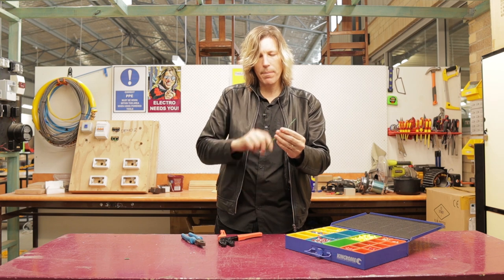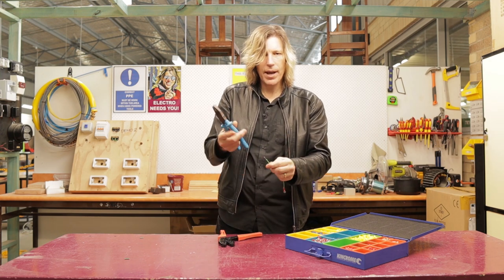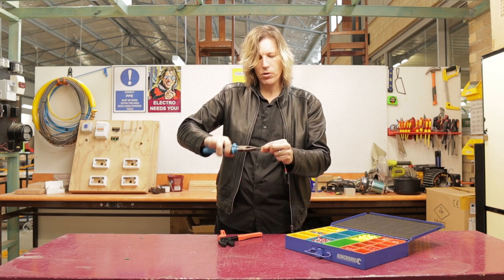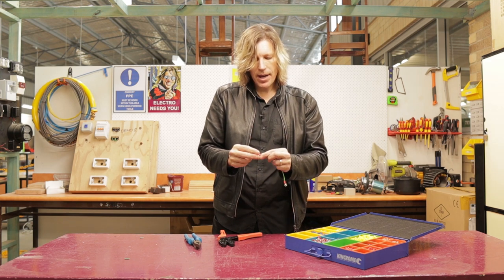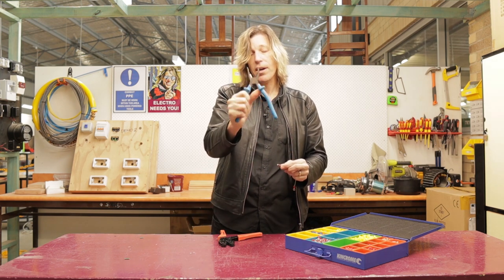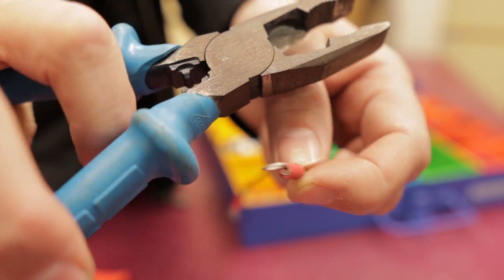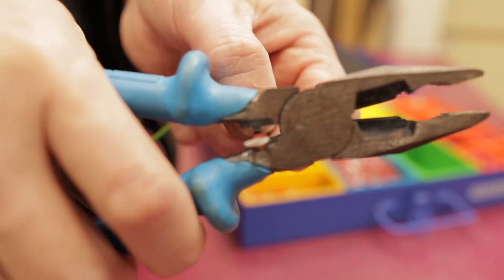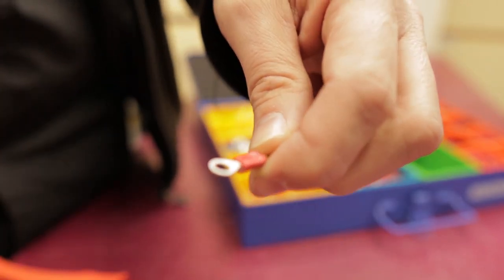Now if I use my pliers, I'll do the other end — it's the same process, but pliers don't have the ratchet option. Again I prepare the wire so the copper cores are twisted. This is the big mistake I mentioned earlier — this is where people get things wrong: they don't twist the wire. With these pliers — channel lock pliers — they actually have a crimping tool at the back. It's the exact same process: I put it in, find the spot that will clamp, make sure it's underneath, squash it down, and there we go — perfectly crimped.